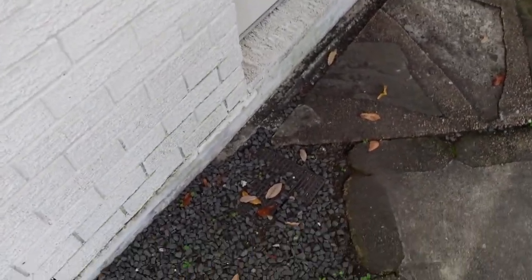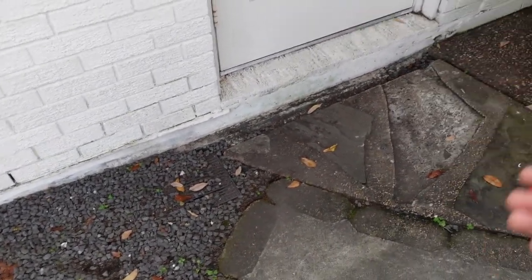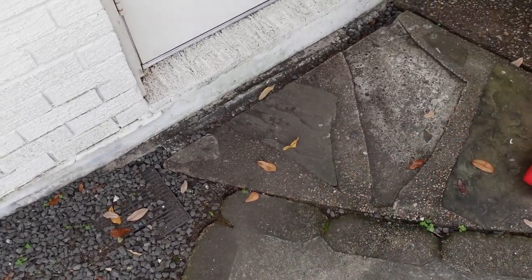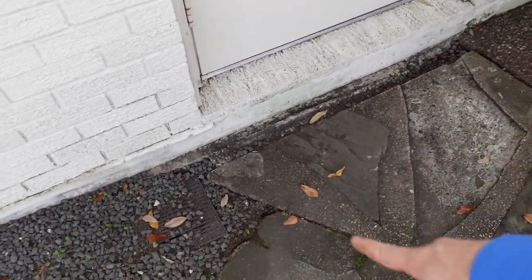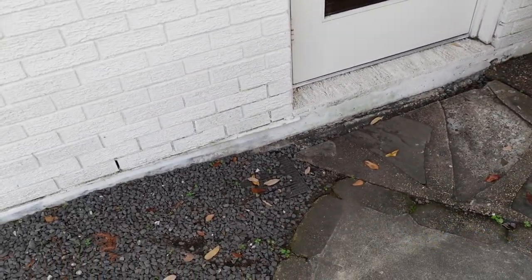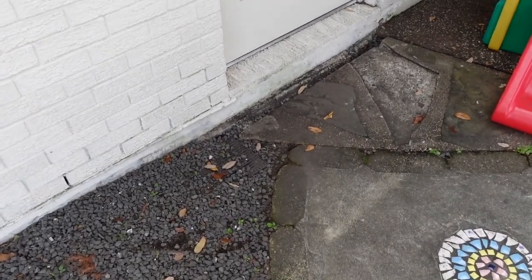Another call-out to bring up is surface drain systems. You just want to document if it's dirty or clogged. You can see it doesn't appear to be performing very well — there's some erosion and it looks like you have pooling and standing water here from the heavy dirt. We'll recommend cleaning out the surface drain system, or French drain system, whatever you like to call it.